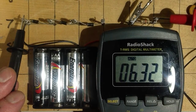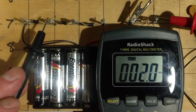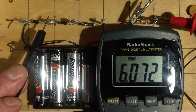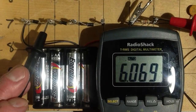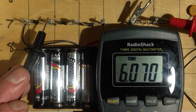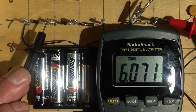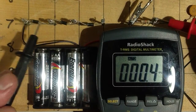What I'd like to demonstrate is what happens if I measure this voltage at the anode of that diode instead. What we're getting is that this diode right there is in series with this circuit and it drops the voltage. Notice it drops it from 6.32 volts to about 6.07 volts — a little under three-tenths of a volt.